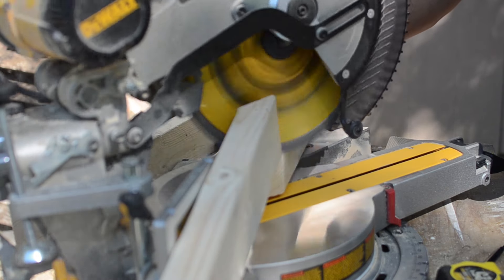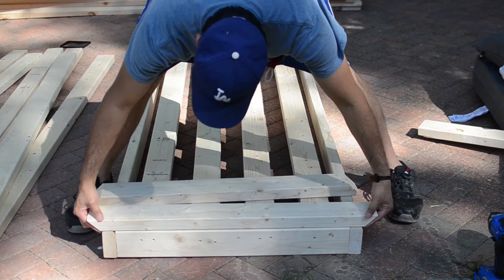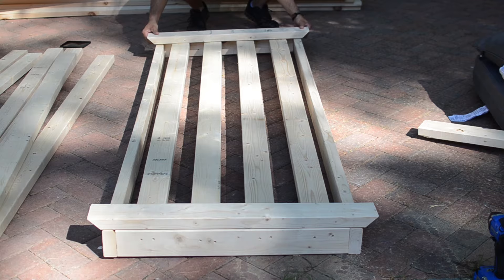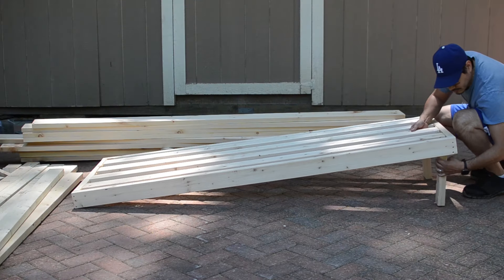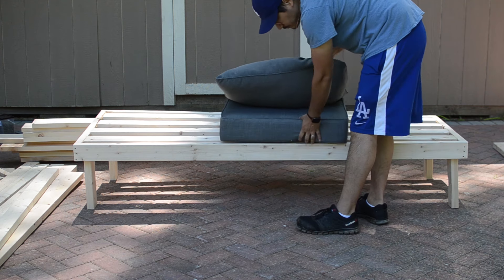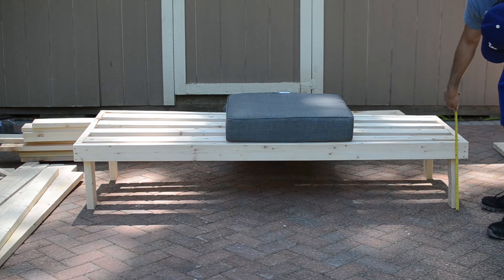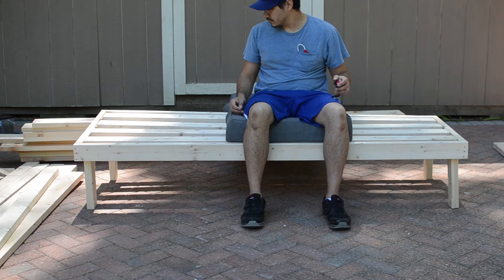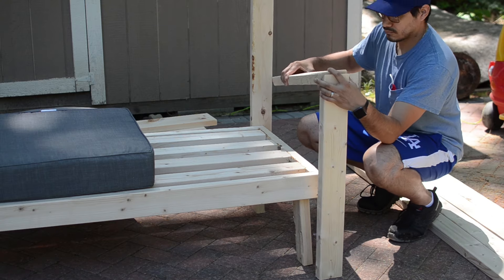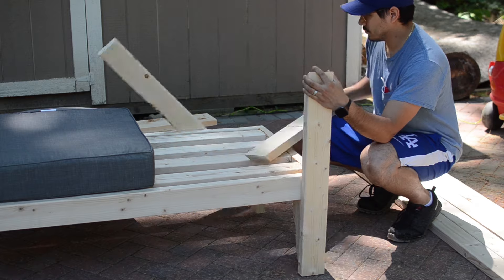The length of the short base was around 29 inches. I then set the seat on four scrap pieces of wood so I could sit down and get an idea of how high to cut the legs of the sides. I went with 28 inches for the height of the armrest, and on each of the 28-inch pieces I cut a 45-degree miter.